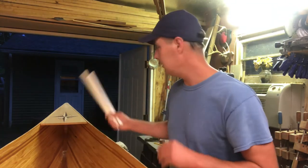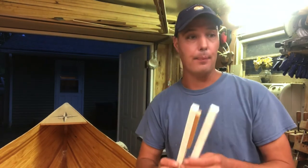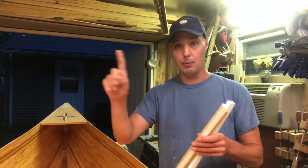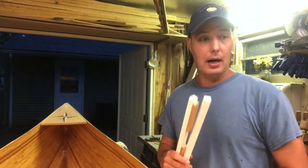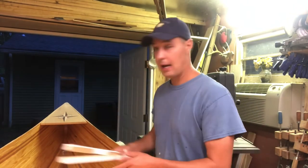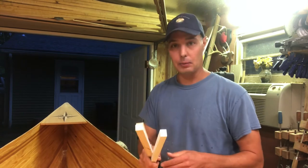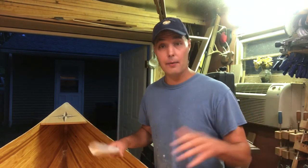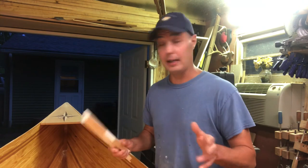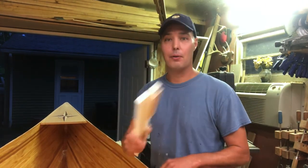At this point it's all woodworking. Get your deck boards in, then pre-make your gunnels. In the next video I'll show you how to mount these — you're not just gonna take a measurement, you actually have to clamp it on and mark it, because your boat curves this way and that way and you'll never get the measurement otherwise. So install your decks, pre-make your gunnels, sand them up, and coat the inside with epoxy. Get them ready for the next video. Please subscribe — thank you for watching, bye.